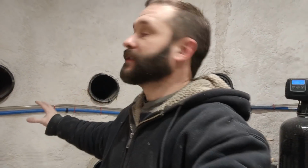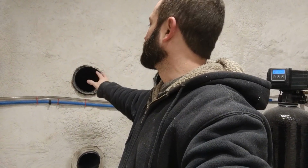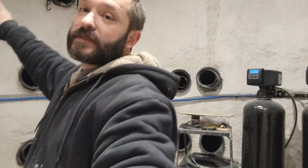And then what I'm going to have to do is build an air handling system here, and I'm probably going to go through an air handling unit as a fan, just because I'm thinking that my ductwork might slow down this nice pressure. But this stuff goes out again up top and gets distributed to the rest of the house. So the air comes in these lower ones and then goes out these higher ones that are all around the room. And those go out to the different rooms, like that one goes out to my office, and that one goes out to the kitchen, and so on.